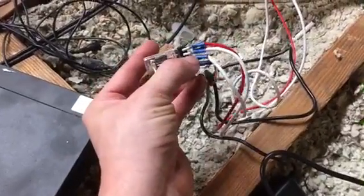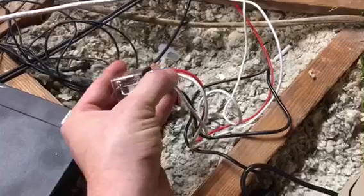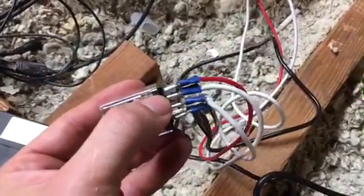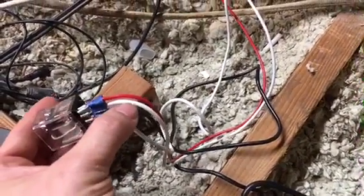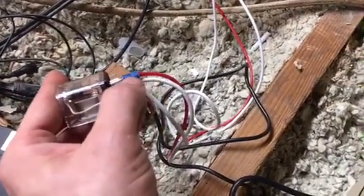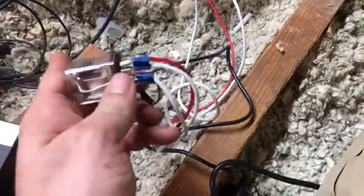Okay, so the next one up from there is the red one. Those 2 wires, one was black and one was tan. Those are the directional wires, the ones that I was telling you are both hot. They're both like black wires. I wired the white one to black, and the red one to tan, or vice versa. I think actually I wired the red one to the black one here, and so that is up, and then the next one down is down. So the 2 are directional.